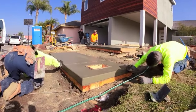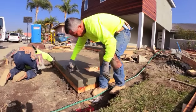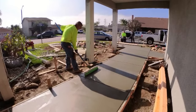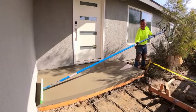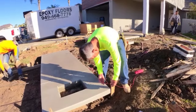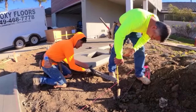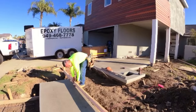It's not too hard of a job because it was already demoed. I did the driveway also — I'll show a video of that. They're just tooling this thing out. You can see on the bottom we left a four-by-four in there and put a real light broom on it. It doesn't rain much in California, so you can use this type of broom and put a light one on it — it stays consistent and doesn't get all gummed up. We use sand around the four-by-four perimeter so concrete wouldn't go underneath it. We just cut sandbags and put them around the whole perimeter of each step.